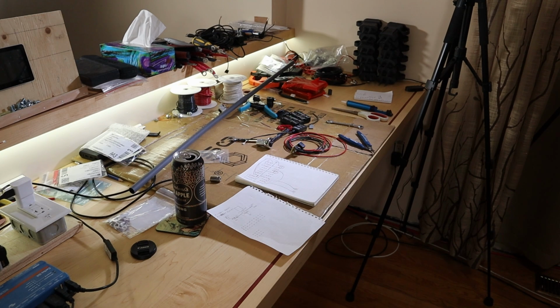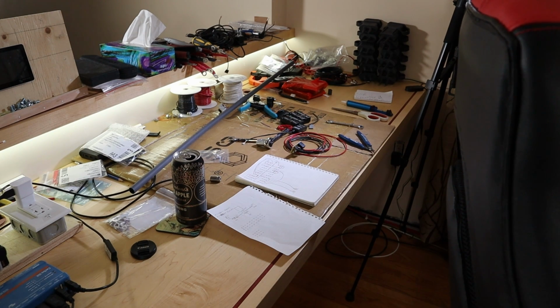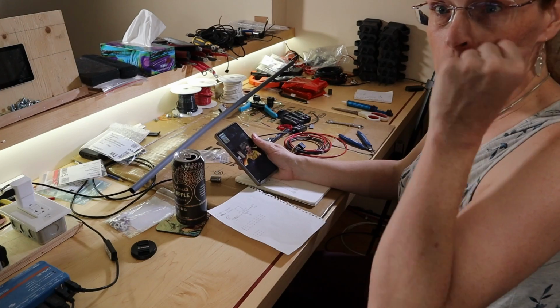So it's possible that negative side could have been lifted up to the positive supply on your other side, and then you would have a reverse polarity situation going on. How would the BMS allow that to happen, though? Well, it disconnects its negative side, and then the other side's floating. Oh. So now you've got your screen connected to a floating connection, and the positive's still connected inside your circuit, but the negative's floating, and now the negative's running all the way through your inverter and then back again. Who knows? There's a bunch of capacitors in there that partially charged up, and if they dump their charge back, you could easily have ended up with reverse polarity on your screen capacitor there.